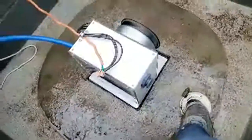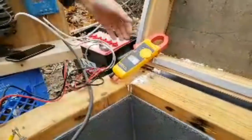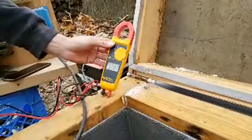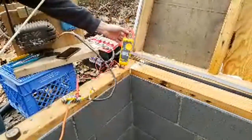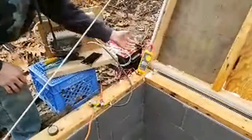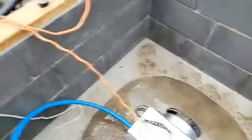So I'm going to turn the valve a little bit to decrease the volts — it's at 130. I think that should be low enough that we could connect the charge controller. So I'm going to shut it off, connect the charge controller, and then see how many watts we can pull out of this.